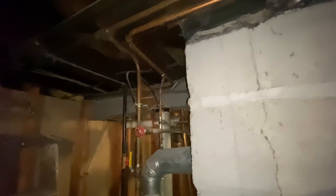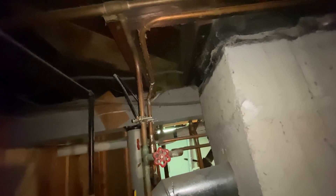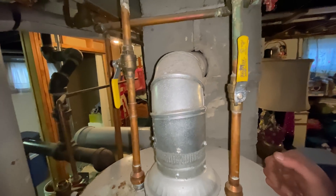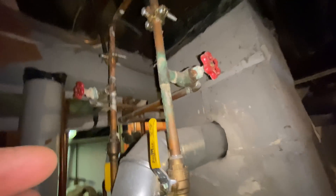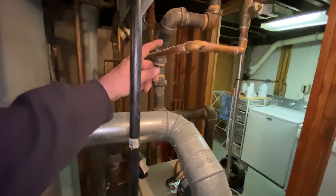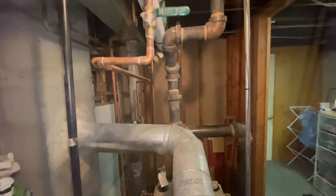Where is it coming from? It goes up, around the bend, and over into the hot water heater. I have no isolation valve for that. I could turn the water off for the house — that's on the hot water side. I could turn this valve off, then I'd have to drain the whole line to swap it. Or I could just cut and pro-press on a new one. Let me go do that.